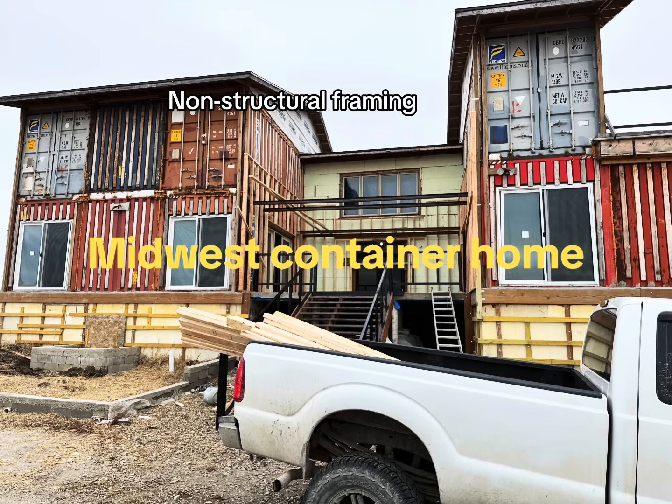It's also so that I can walk, because I've decided to have my windows and doors recessed. It's so that I can kind of box around it appropriately, and that gets the water away from the doors and windows. So that's the reason why I'm framing. What you see there is the south.